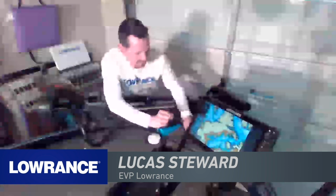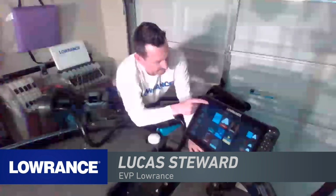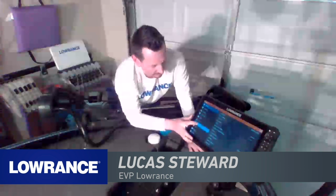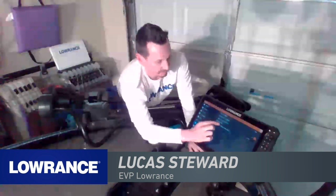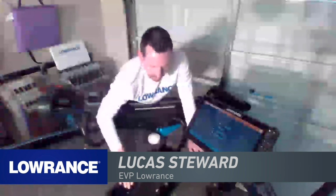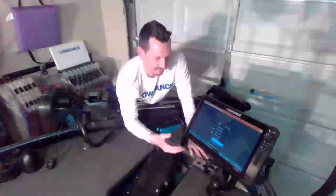All right, looks like we've got a lot of questions coming in, so that's great. So first thing I'm going to show you is how to configure these shortcut keys on your HDS Live. So press your Pages button, go into your settings, go to Autopilot, and there's a Configure Trolling Motor keys right there. And now it's going to tell you for shortcut key 1, 2, and 3, how to change those key functionalities. So within that list, you have several options.